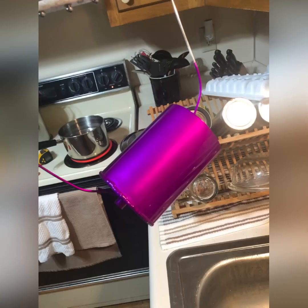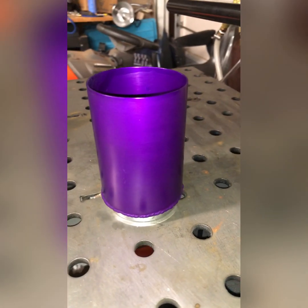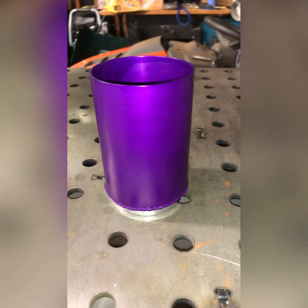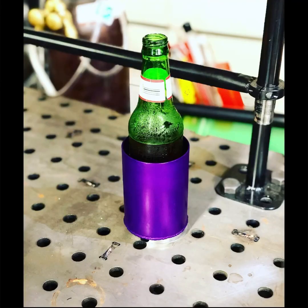Unfortunately I had to completely re-prep the part and rerun the whole process, but we all screw things up from time to time and that's just part of it. And here it is — after all that trouble, I actually got somewhere. After removing the part from the anodizing bath and cleaning it off with distilled water so I don't get battery acid in my dye, I let it soak in the dye for about five minutes then gave it a good rinse. Next I put it in water heated to 180 degrees to seal off the anodizing — remember not to touch it between any of these steps or you might screw it up. And here we go: after all that work I have the world's prettiest cup holder. I bolted an industrial-size magnet to the bottom of it so hopefully I won't knock it over — now I think I'm ready to drink some beer in style.